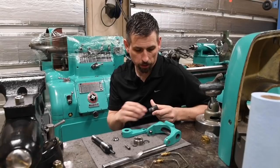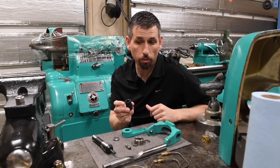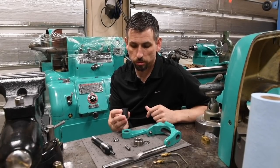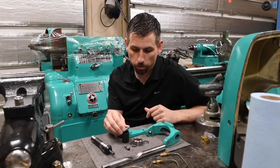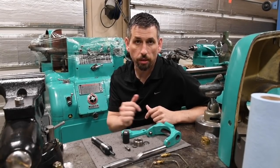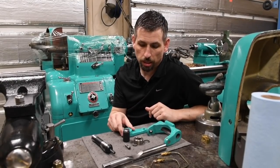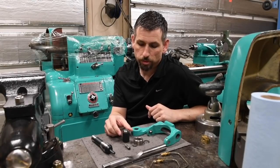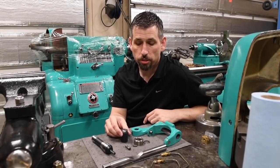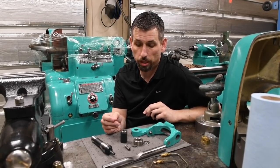So making one is what I planned on. I just went to O'Reilly Auto Parts and bought a cheapo Titan brand external Torx socket. What I plan on doing is basically just milling down everywhere except for where those four slots need to meet up with the socket. This is just going to be quick and dirty - it just needs to fit over this nut and be able to turn it with a little bit of torque on it.